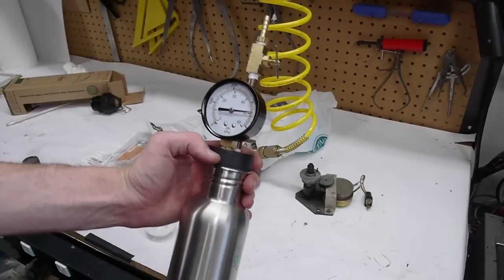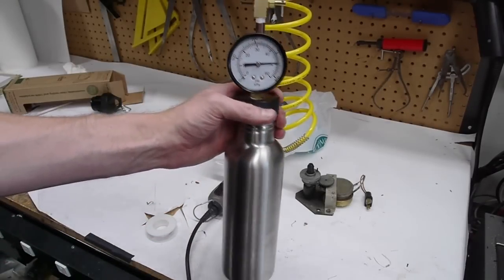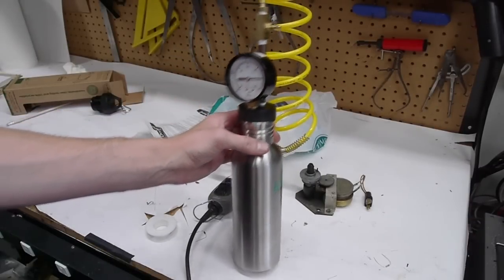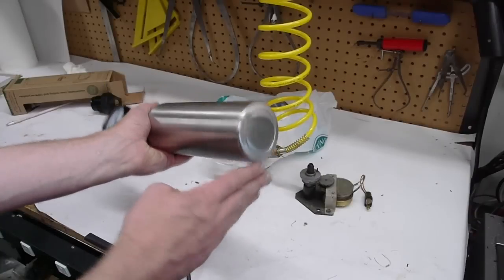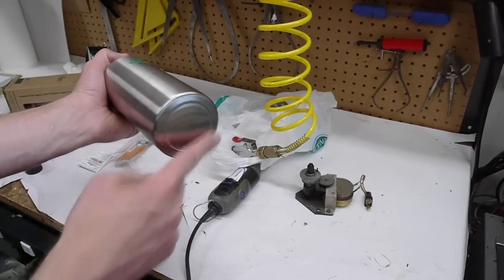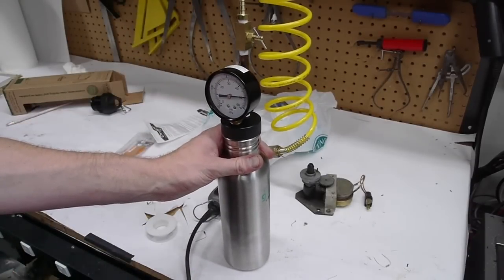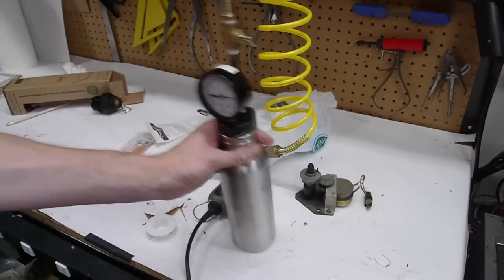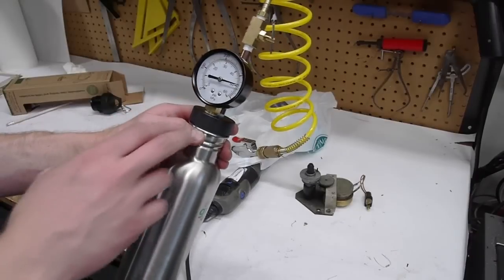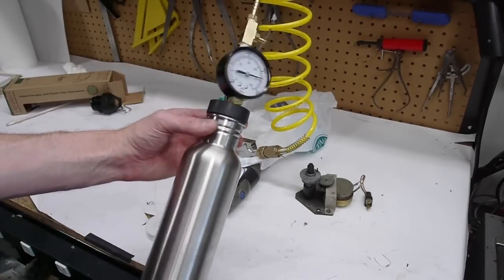Here I am pressure testing the vessel. I got about 50 psi in there. One really unexpected consequence is that the bottle doesn't stand up anymore because the bottom is bowed out a little bit. I suspect it had a slight kick in the bottom so that it would always sit flat on a table, and now it doesn't have that anymore. So I'll have to either build another base or just live with it. I'm going to leave this amount of pressure in here for a while and see if there are any leaks, which I don't think there are.